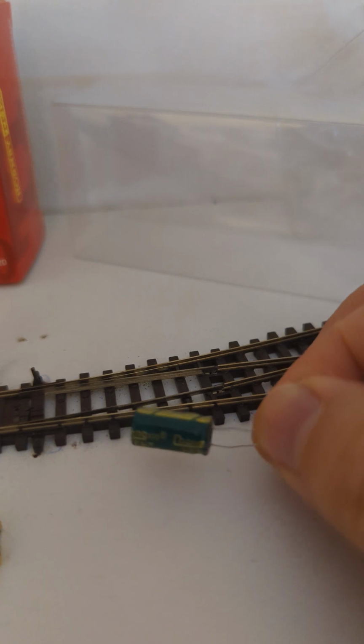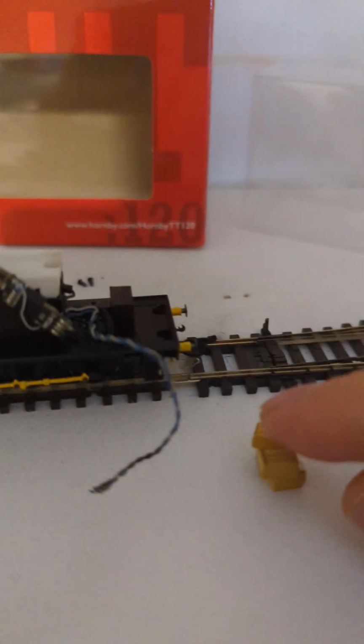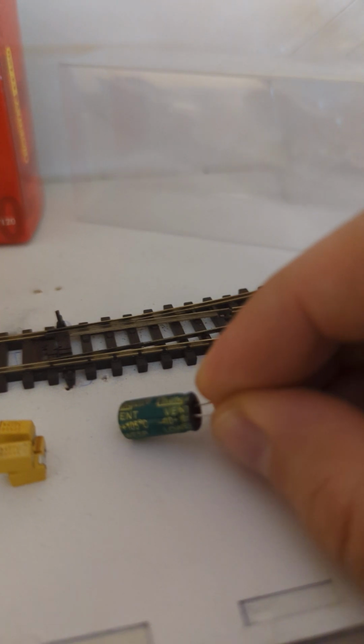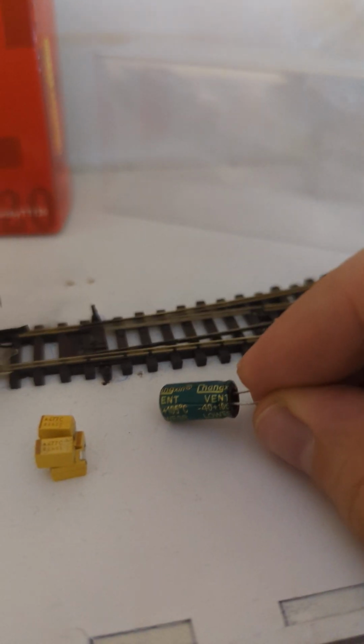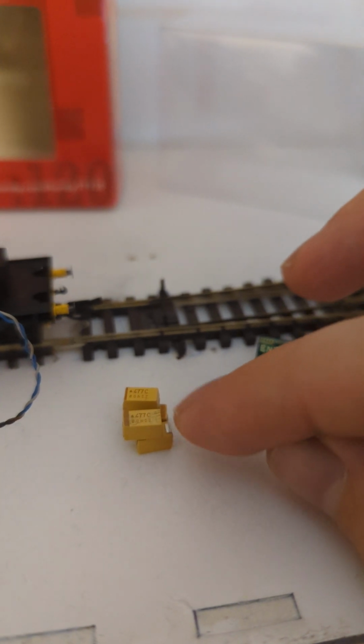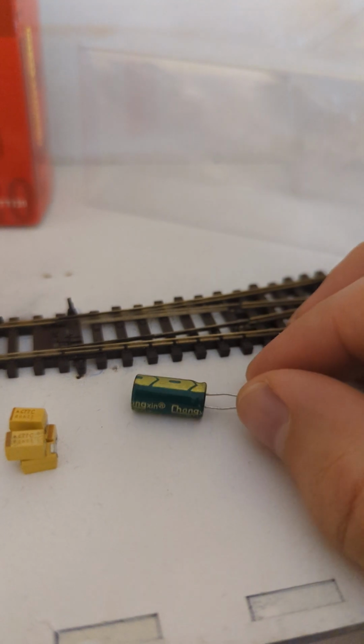Because a smaller one of these, I mean, by the time I've stacked up 4 of these to get me 400, could I just get a 400 of this, maybe at 25 volts instead of 35 volts? I noticed the difference between 35 and 25 on the tantalums made no difference to the package size, so I may as well get the 35. But 25 is probably okay.